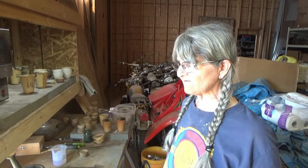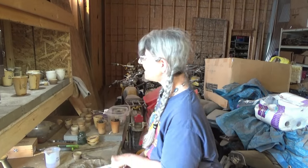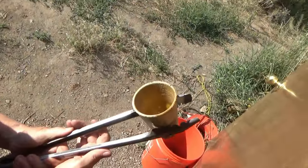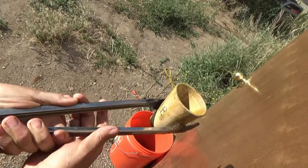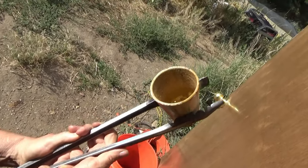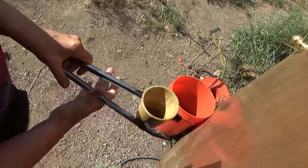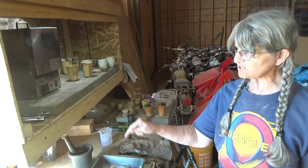So anybody's guess what kind of bead we're going to see in a few minutes. Right now we're just going to wait for that slag to cool so we can get the button back in there and turn it into a bead. In the meantime, we're going to take a look at this in the sunlight. One of the characteristics of a good slag is that it prevents degradation and erosion of your crucibles. This crucible has been in use well over a year, and because I keep a very careful eye on my slag, it's still in really good condition. At the moment I am not seeing any beads of metal, precious or otherwise, on the walls — so that looks like a clean pour. It's going to sit there and cool, and we should hear it explode very shortly.